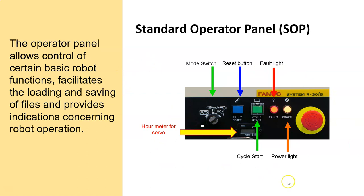Some panels have additional features not present on the R30 IB, such as a fault reset button — on our robot, we reset faults by switching to T1 mode through the teach pendant. Some panels also have fault and power indicator lights, which on ours are shown on the teach pendant instead. You'll also note that some panels have an additional T2 mode on the mode select switch; our R30 IB has only T1 and auto.